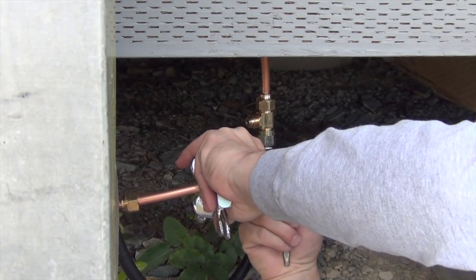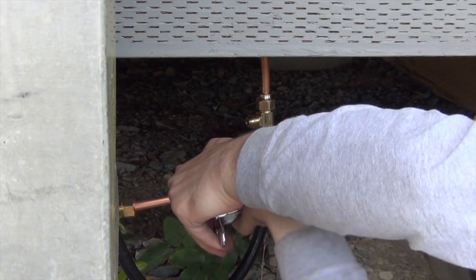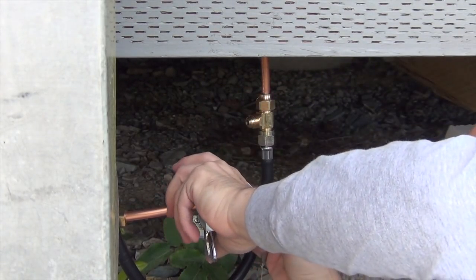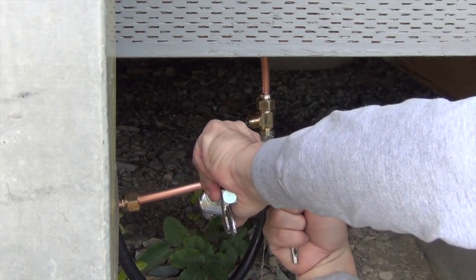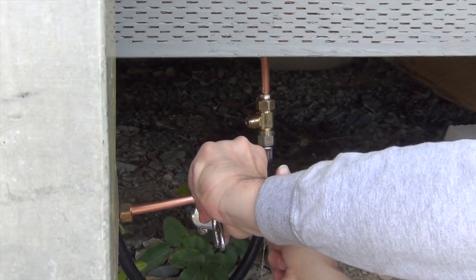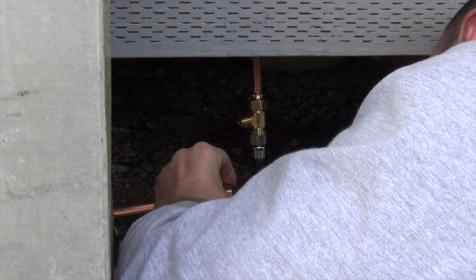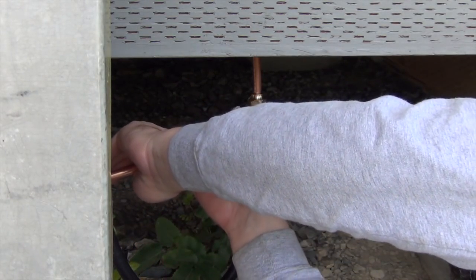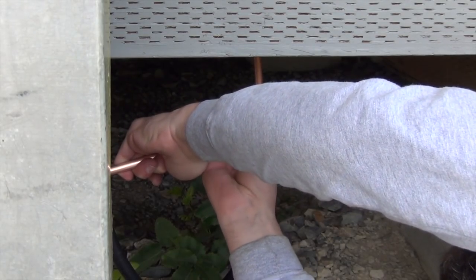Okay. I've had the most luck working it forward. Again, I don't know if this is code, I don't know what technique, but I work it, back it off, bend it, back it, and I think that's the burnishing of this thing, working it back and forth, rather than just one swoop, cranking it down. It's not the best looking one, but it looks fairly even inside of there. I don't know. I may need to do this one more time. For some reason, this one's leaving little marks on there. Maybe I need to get it tighter on that little clamp.